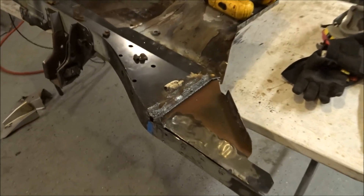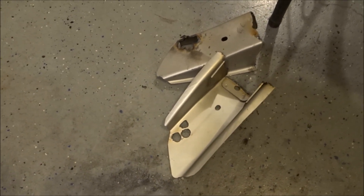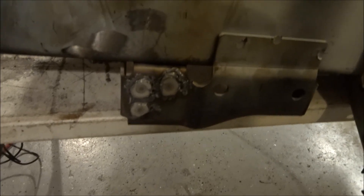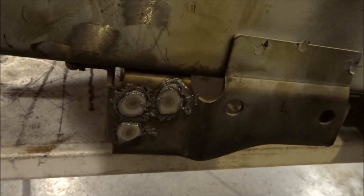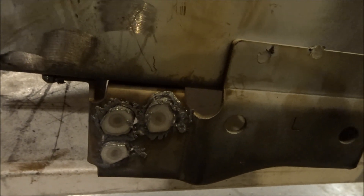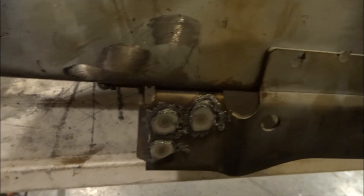There you have it — just an example of it, you can see it separated on its own. On this one I started perpendicular using what's known as piercing. Depending on how thick the metal is and the machine's capabilities, I had the settings pretty low for gouging and was confident it would pierce mostly into the metal I didn't want while leaving the metal I did want alone. When it ignited, sparks went everywhere and it blasted through, pierced the metal, and then I did my circles.